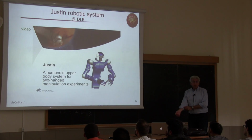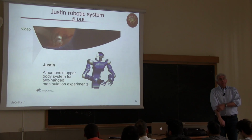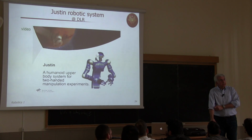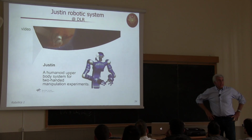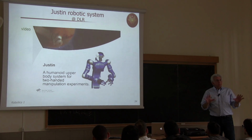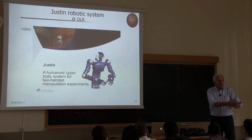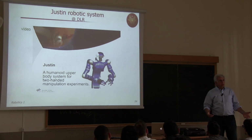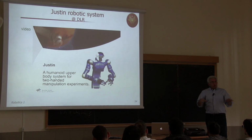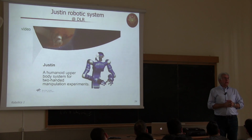So this describes the system. Start from the kinematics, the components, and then moves to the software architecture, which is very important for devices like this. They have so many degrees of freedom that have to be coordinated, but still you can recognize some modular structure: the right arm and hand, the left arm and hand, the torso, the visual system, the grasping system, and so on. You have to have local controllers which provide mobility, but everything should be coordinated and driven by the actual task.